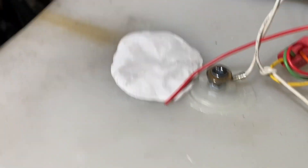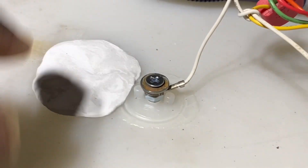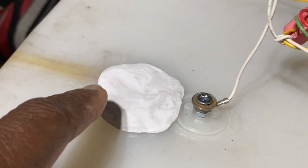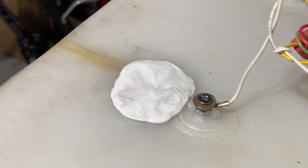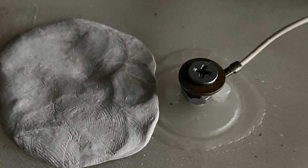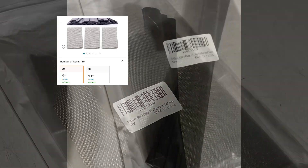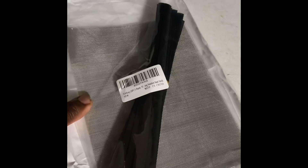So I repaired it that way — got that repaired. Now we're going to let this get a little hard. I got some stuff coming, but I'm going to do another process where I'm going to put some mesh in there, then seal some more plastic around it to make sure it doesn't come up. Got my package from Amazon — got a plastic welding rod and a steel mesh screen that I'm going to use for this tank.